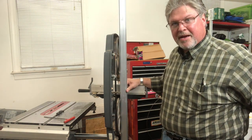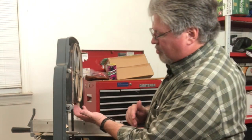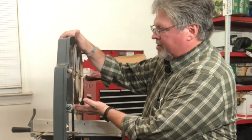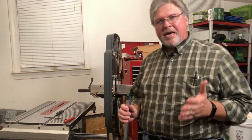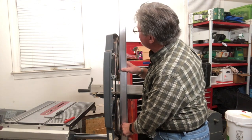If we've lost that gap because the bandsaw has been stored under tension, here's how to restore it — it'll seem crude, but it's not unlike adjusting an institutional hinge on a cabinet. You grab the bottom of the upper wheel, put a little pressure against it with your palm, grip the top of the saw, and apply a slight tweaking motion. You might think you're bending it — you're not. You're straightening it. It was already supposed to have that bend, so you're returning it to its intended condition.